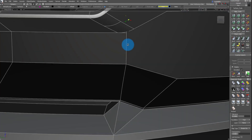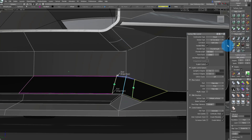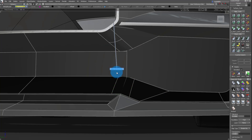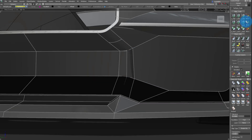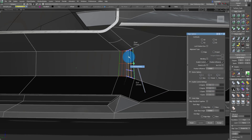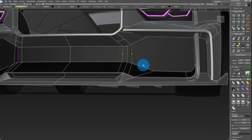We're going to work our way from the top and slowly move down. I'm just going to add a fillet between these two surfaces, trying to get a size that's just a little bigger than that top fillet it's related to, because those two surfaces are touching. Then I'm going to isolate that top fillet, connect them, and use this surface to align it to the back grill surface so my grill and the back facing of these openings are all nice and closed up.